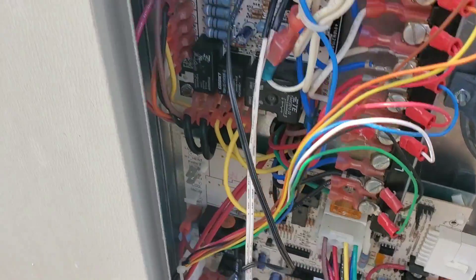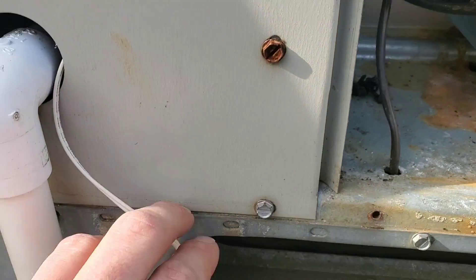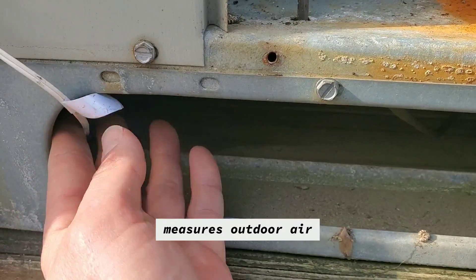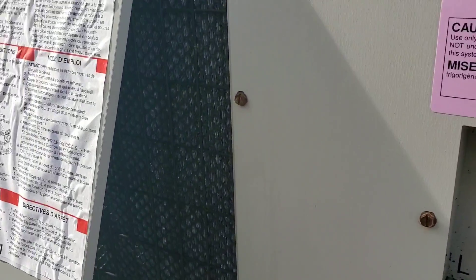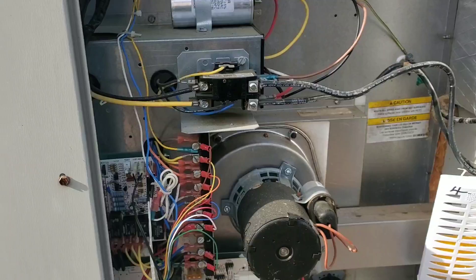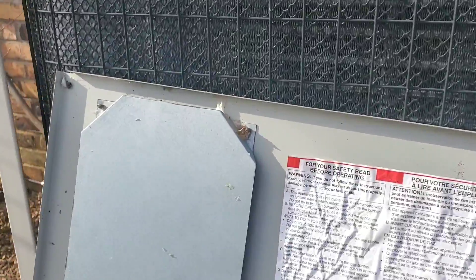If you have any more questions about demand defrost — what you should check — definitely comment below. Here you can see all the wires: the M terminal goes to this contactor. You have your ambient sensor and coil sensor connections. The ambient sensor is plugged in down here, underneath in the base panel of the unit, and it's positioned out of direct sunlight — that's very important. This is a dual fuel unit so the backup is not heat strips but actual gas. This is your outdoor coil, and the coil sensor is on one of these U-bends. I've already replaced this board and tested it — works well — but I want to show you the basics so that when you have a call you know what you're doing and what to look for.